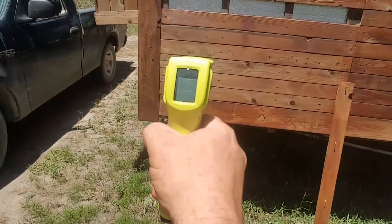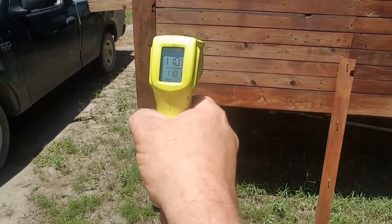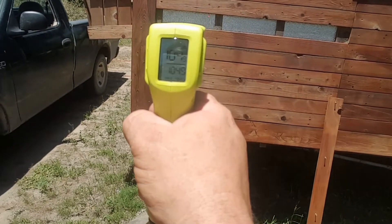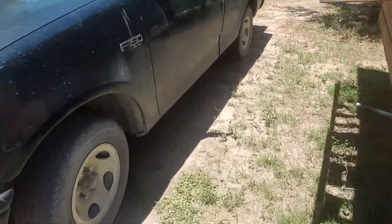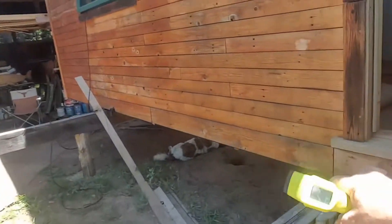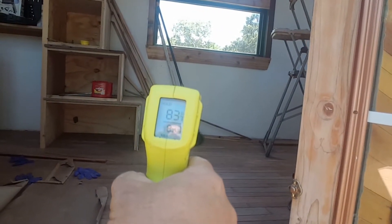You'll want to maintain it once a year. Let's see what we've got here as far as temperature. I've got 109, 110 degrees on the outside of the siding where the sun's hitting it. Then on the actual radiant barrier, there's 10 degrees cooler — 100 degrees. And then on the inside wall, there's only two inches of insulation, no sheetrock, and it reads 83 degrees. So we have a 17-degree difference from the inside to the outside.